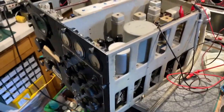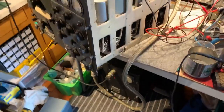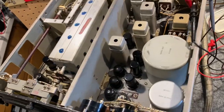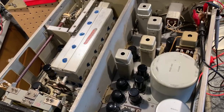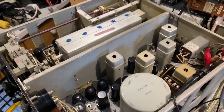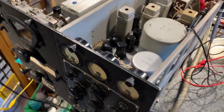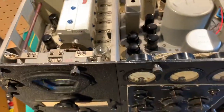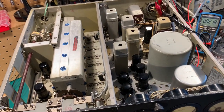I've just been doing some preliminary checks on this. I checked the power supply yesterday and that's looking good and working great. I've done some resistance checks on the receiver. I've taken all the tubes out and tested them — one or two are a little weak, but they're not bad. Some of the others are better than new; they actually test really good. So I put them all back. I've given the chassis a little bit of a clean up. It was actually pretty clean. I haven't touched any of the switches or controls. I've done some resistance checks on capacitors and across the plate supply to ground and screen supplies to ground. Everything looks kind of okay.